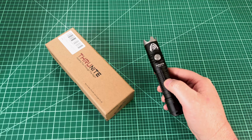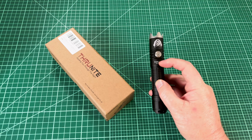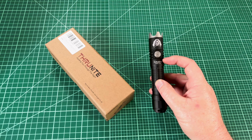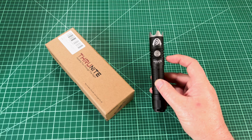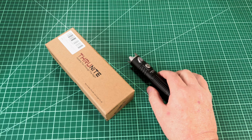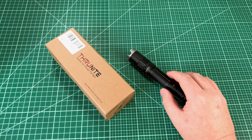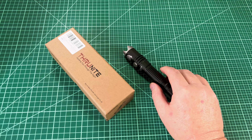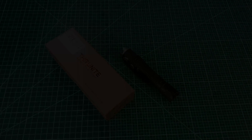Let's show just how green this emitter is with some white wall hunting. Here's a Zebralight with an LH351D Samsung emitter — slightly above BBL, about 30 points — looking fairly neutral. Here's a high-end custom with a very rosy emitter. Now I'm adding the BSS on the left. You can see the difference. When the BSS makes the LH351D in the middle look rosy, that is a problem. Very green.